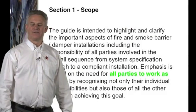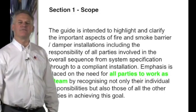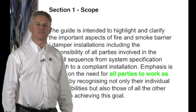Current UK testing of a full range of products is being replaced by harmonised European standards. This could bring about some confusion on which standards have been used for which projects and how much education has been done within the team. For dampers, there was an ad hoc UK test standard BS 476 part 20. We now have the European standard in place and a product standard BS EN 15650.